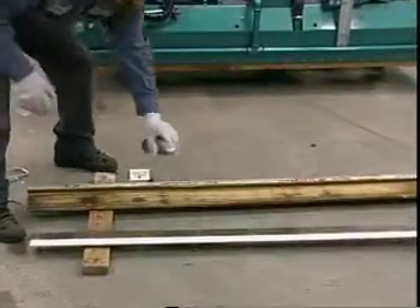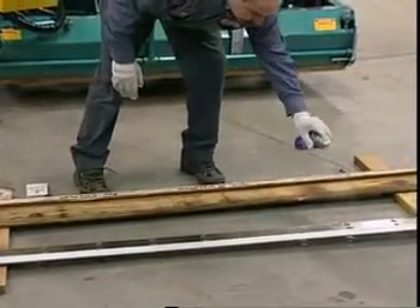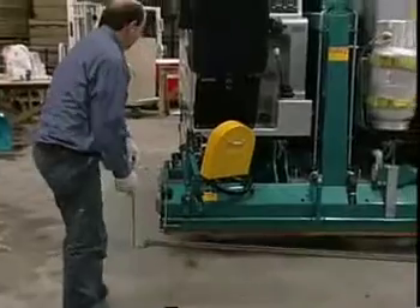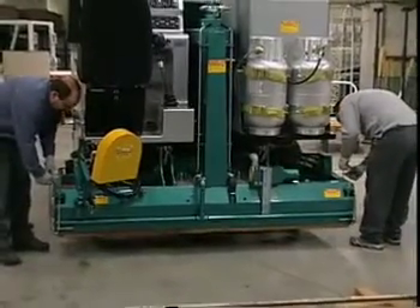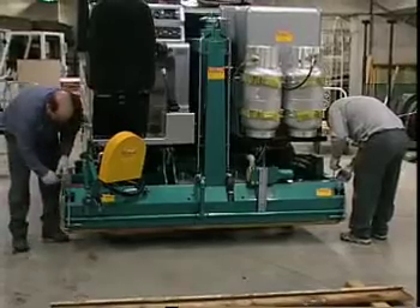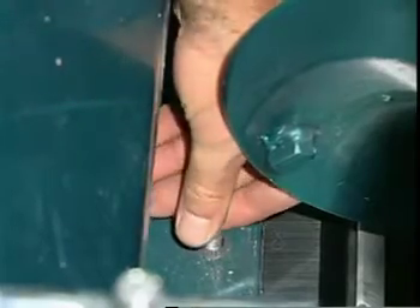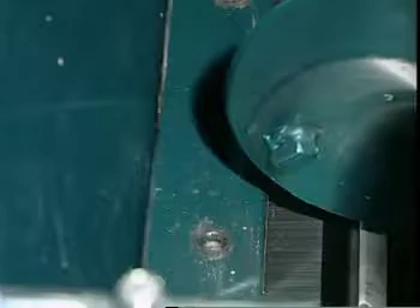Make sure the blade has a light coating of oil. Put it on blocks at the rear of the conditioner. Using the blade hook, lift and slide the blade underneath the conditioner until the attachment holes line up. Tighten the blade hooks onto the conditioner and install the blade bolts and finger tighten. Remove the blade hooks and insert the remaining two blade bolts and tighten.